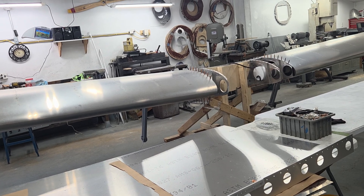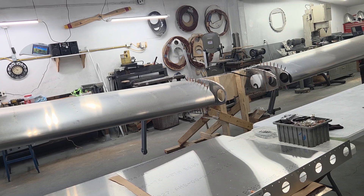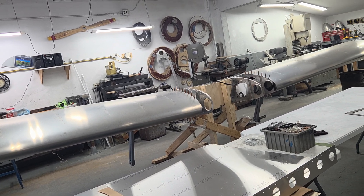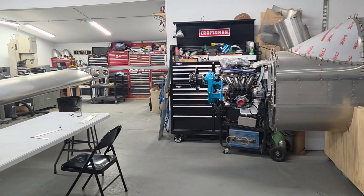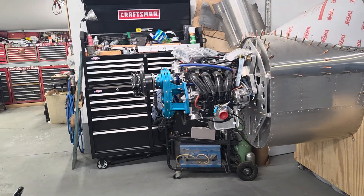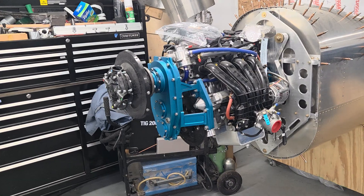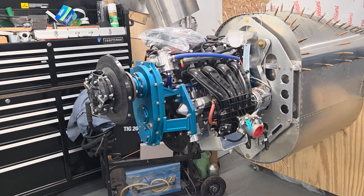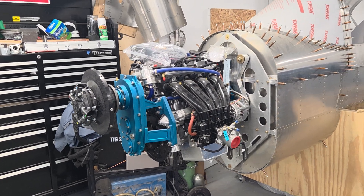So that's where we're at. It won't be too long and we'll have the wing closed up, mounting the fuselage on its wheels, and we'll probably do some engine runs once we get the radiator on — because that's a liquid-cooled engine. We can also run it for a very short period without a propeller, just to make sure it looks good with a fan blowing on the radiator, so we can run it in the building here, which will be safer than having the prop on it.